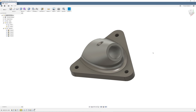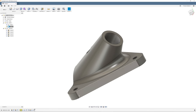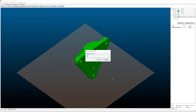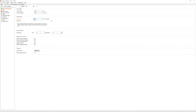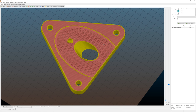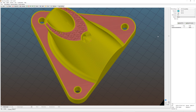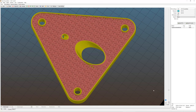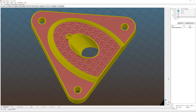If any of you know how to change Fusion 360's behavior so the XYZ axes align with what your printer is seeing — so you don't have to rotate your part every time you import it into the slicer — please drop that in the comments below, because that's really bothering me. For this part, because it's going to see a lot of forces and stress from pushing the tool around, I wanted it as strong as possible. I believe the theoretically best infill structure is Gyroid, and PrusaSlicer does have that implemented, so I gave it a shot — and I think it turned out rather well. Prints fast, too.